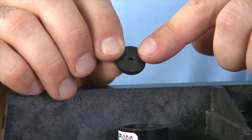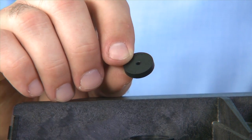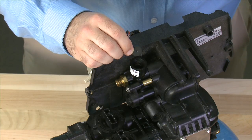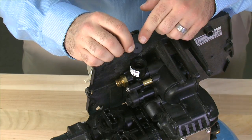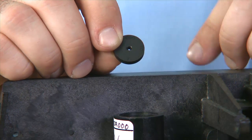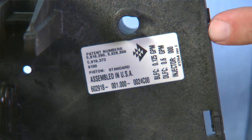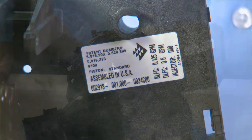We can try to clean this with warm water and a soft brush, but should not use any metal tools to poke through the flow washer. If you need to replace the flow washer because you cannot clear the clog, you would want to match the number that is on here. If you are unsure what it was, you can check the housing or check the tag that is on the backplate under the cover to make sure you match the correct flow control.